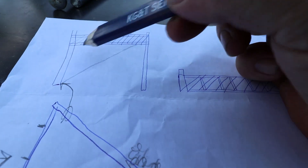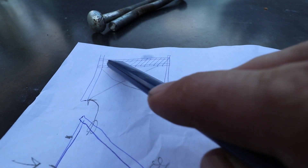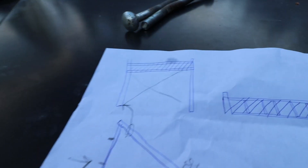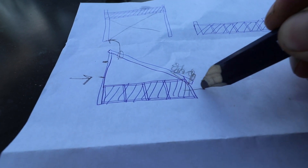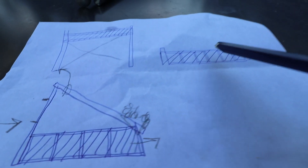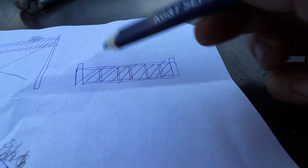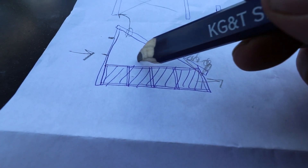We're going to leave the bottom area open so we can drive in with the bucket. We're thinking this is going to be a kind of framed piece and we're going to use plywood as sheathing. That plywood will give us a lot of shear resistance or racking resistance. But in order to keep the soil from wanting to blow out the front as you push it with the bucket, we want to create a box inside. We're actually going to build a kind of truss inside and line it with plywood on the inside.